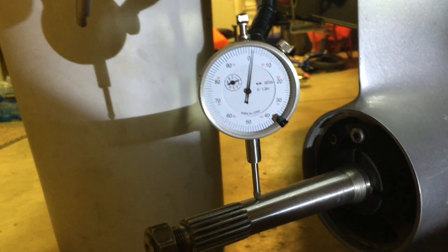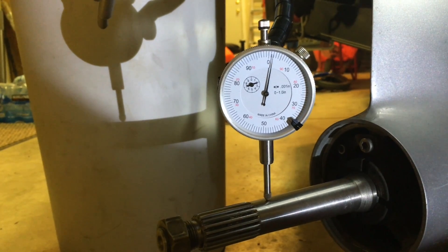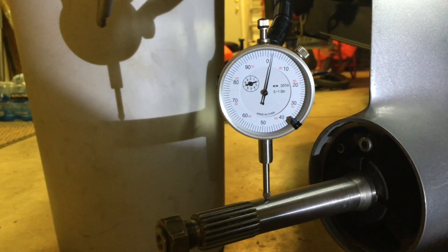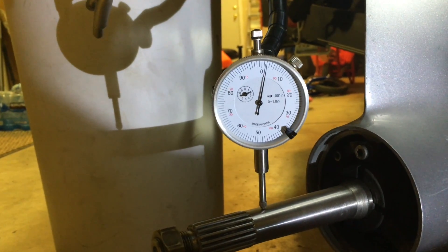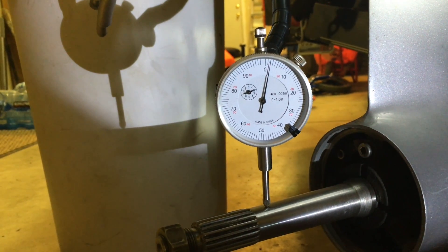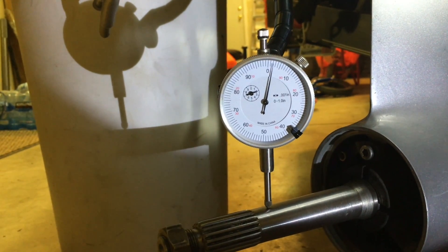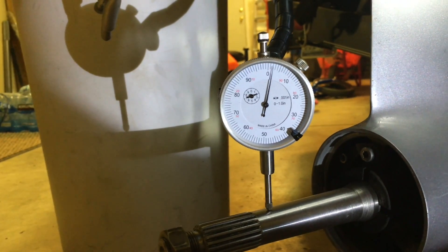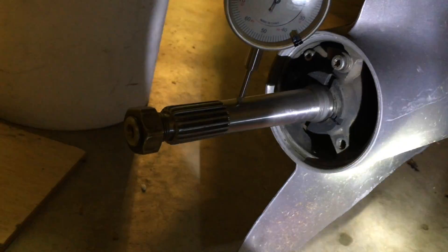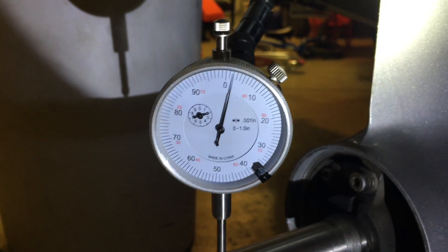That's about a hair under two thousandths of an inch. I'll check that in the morning — I didn't do any heat so it shouldn't matter. I think we've got ourselves a pretty true shaft going clear from 52 to two. Amazing — I'm surprised it would actually work quite so well. Good news: that method does work, you just have to be patient and learn how much pressure it's going to take. I haven't seen any issues at all and don't expect any issues with the gear lube, but we'll watch it closely. The alternative would probably be $800 to have the prop shaft replaced or get a new one — all the bearing carrier and labor would have to be changed out, so it gets kind of involved. Good deal.